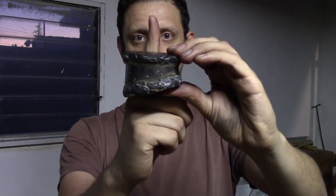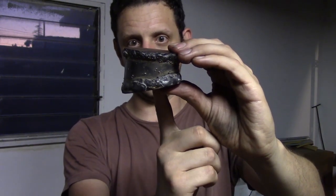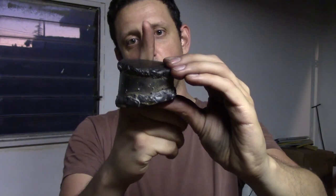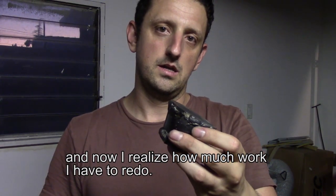So one bolt goes straight up here, through the top part, which goes to the aluminum GTO mounts, and then a bottom one has to go like this through the bottom of the subframe. So I'm going to have a bolt like this and a bolt like this, which means I might have to cut one of these flat pieces off, drill a hole through both sides, weld bolts in, and then weld it back on again.